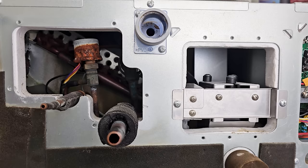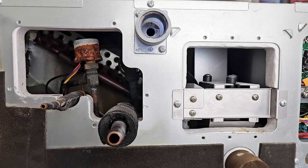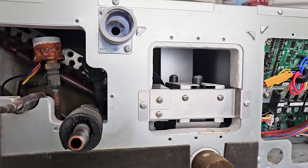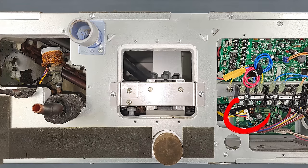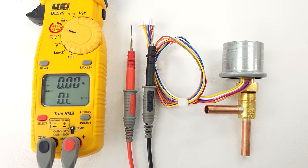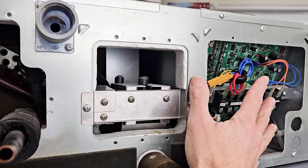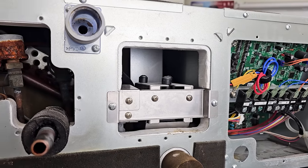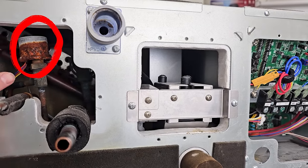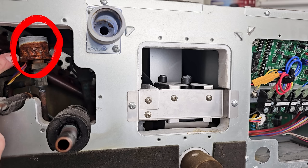That's all the way up. Now, it's important to know that during operation, while the system is running, it's not constantly sending 12-volt pulses to the EEV. It's only sending those pulses to put the EEV head into the position it wants, and after that it's no longer sending those pulses. So it just sits there with the pin at a certain position in the non-powered state.